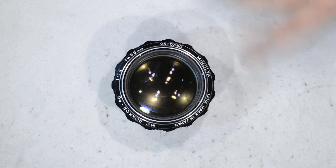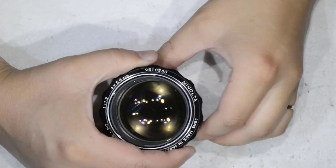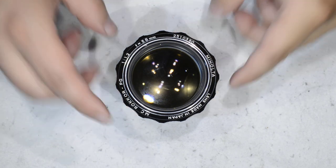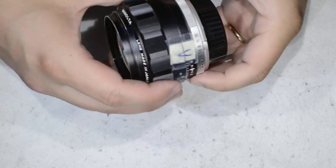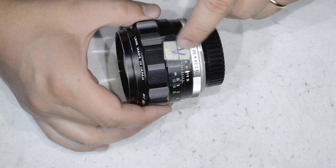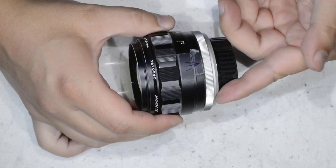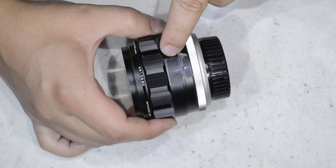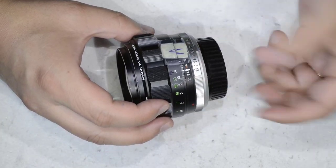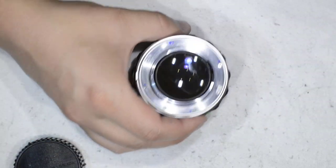The lens owner will have it good for another 20 or 30 years. This lens is quite tricky to open, so please follow the instructions I will provide. I'm doing some marking here and then covering it with tape, since I'll be working with the lens multiple times with grease and oil and the marks go away. I put tape over the marks — this seems to work well — and this is just for indicating the infinity position. I recommend you do that.